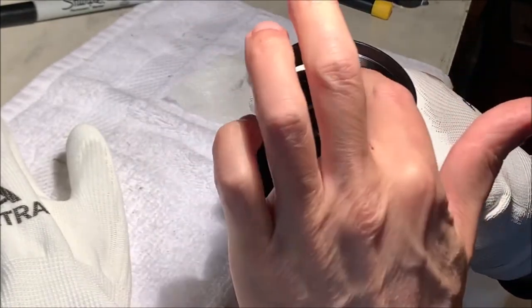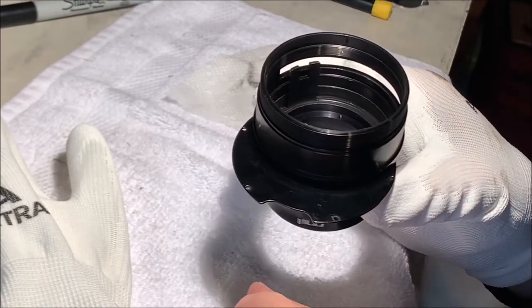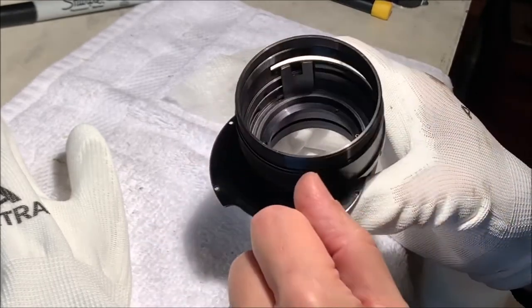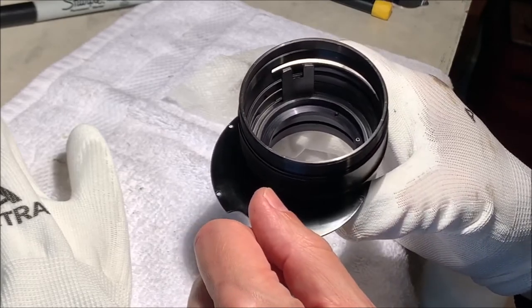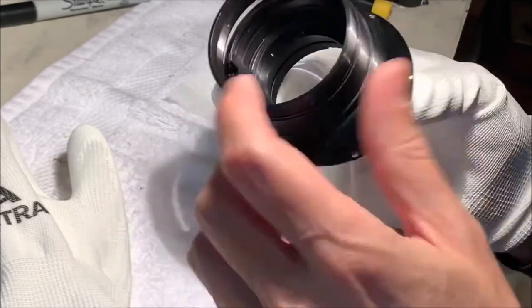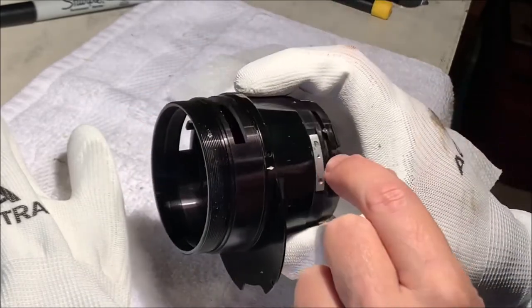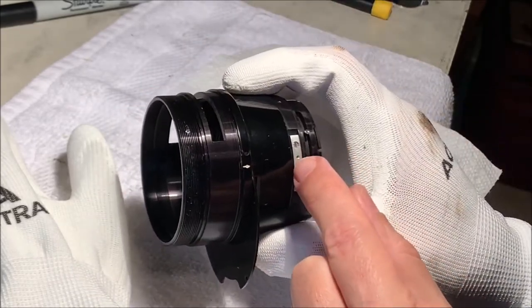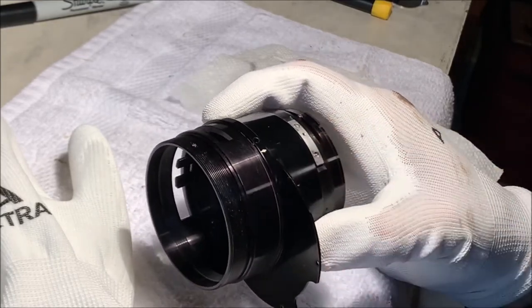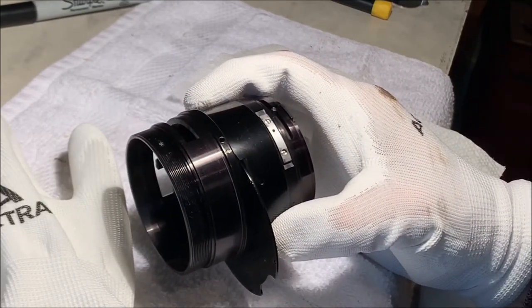For review at this point, we could just turn this around and unscrew the helicoid, because it has a very small amount of axial movement for its rotation - it's probably a single start, so orientation isn't important, but I always assume it is because I might be wrong. This rotation is still stopped by this key in its axial range of travel, so this key is still going to be removed. I have some solvent on there to try and loosen up those screws which are not budging yet.